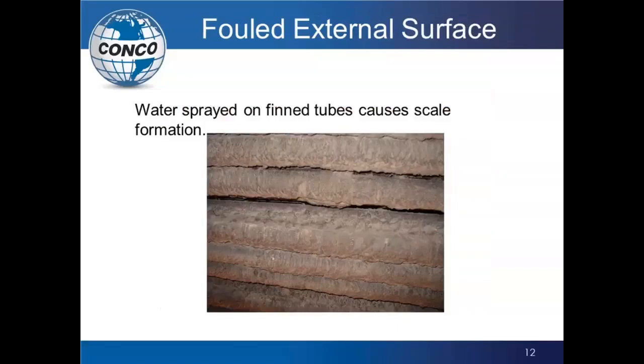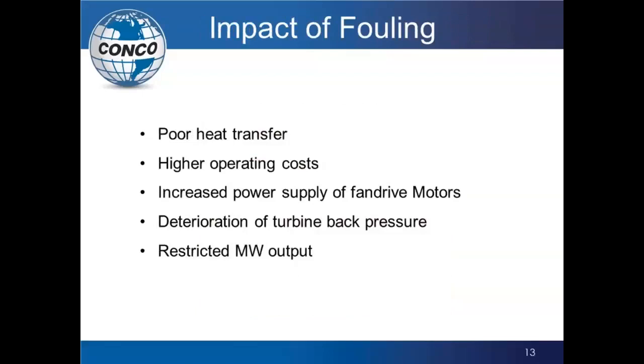Also in the summer, we've run into situations with that energy penalty where the air temperature is quite hot. To keep the unit working efficiently, we go out and spray the fins with water — but whatever's in that water is now going to scale out on those fins. So now not only do we have debris fouling between the fins limiting the air, but we've got scale on the fins as well, which becomes a serious problem for removing debris and allowing air through.